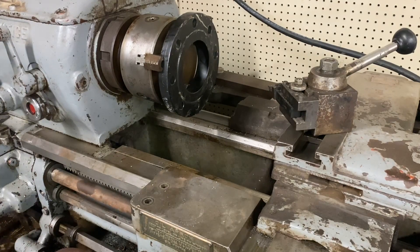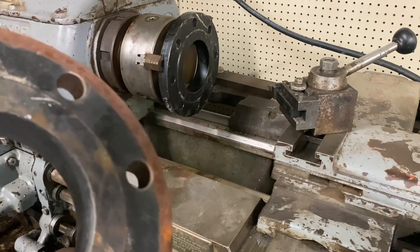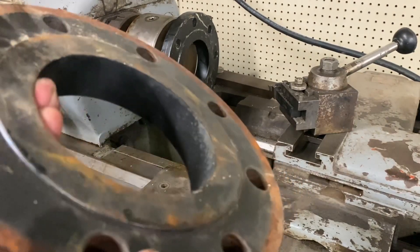Now the setup — what this farmer really needs to do is cut it out and put in a dismantling flange, which is made for taking stuff out. This is going to be part of a flow meter. But dismantling flanges are expensive and there's a lead time on them, so instead, for removing purposes in the future, he wants me to shave a hundred thou off each one.